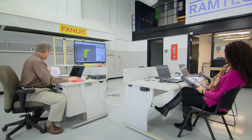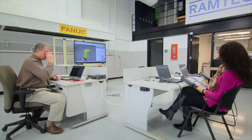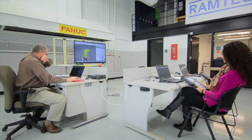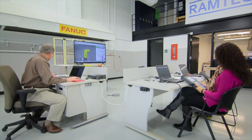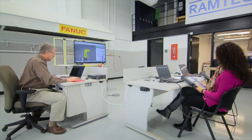For the remainder of this part of the chapter, we're going to look at the function key — a really important key — and see how we can alternate between full menus and quick menus. Find the function key; you see it's near the upper right-hand corner. If you look in the book on page 55, you'll see quite a few selections, but one you use a lot during robotic programming is the very first selection in the function menu: abort all.